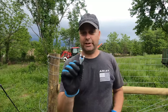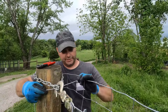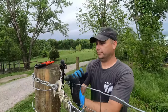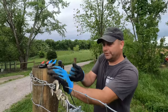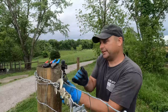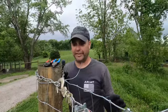To tie this off we're going to be using a Gripple T-clip. We take the T-clip, hook it over the fence, then push our wire through the clip and pull it as tight as we can. When the wire pulls in, it locks into place and won't back out — basically pulling on the wire and pushing on the fence to get it tight. Then we cut it off and bend it back over itself so there's a second layer of protection to keep it from pulling out.